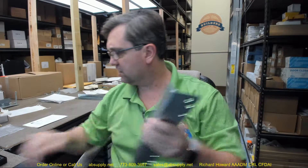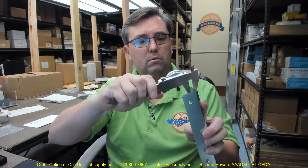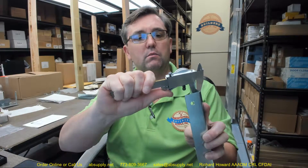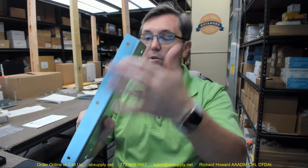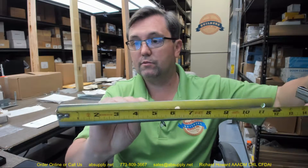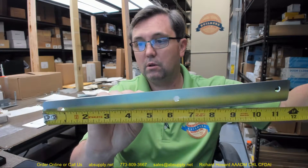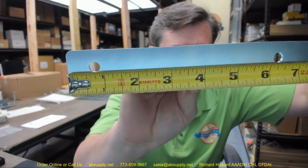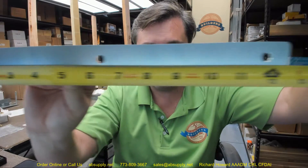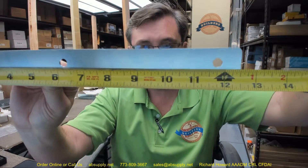The material thickness is about a hundred thousandths, .09 inches. These three holes attach to the underside of the lid. The length and dimension of those holes from one end — they are symmetrical. The first hole is about 3 and a quarter, the middle hole about 6 and a quarter, down to 11 and 3 quarters.